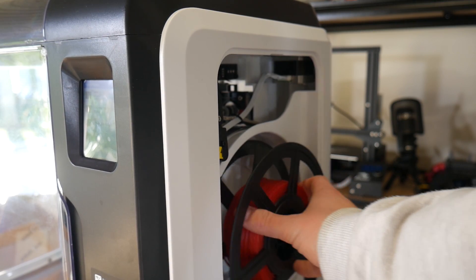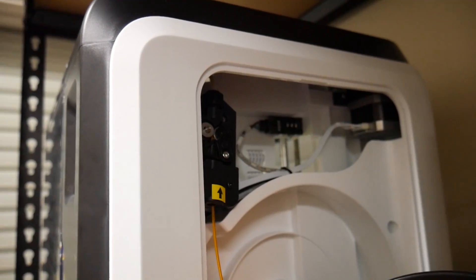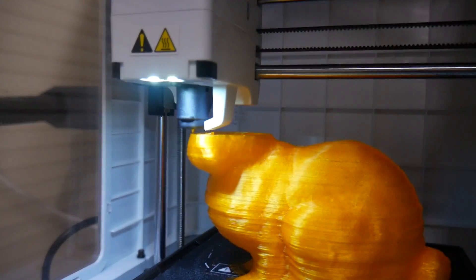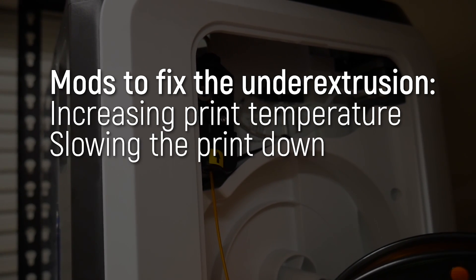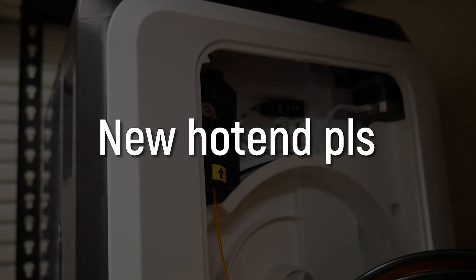At this stage, swapping between the sample roll and a few other filaments, I noticed the extruder start to click. The print quality got worse and then went insane — I have no idea what happened to this rabbit printed in ABS; it's just an absolute disaster. What caused this is unknown to me. It might have been a time thing or caused by one of the filaments I was testing. But researching the Adventurer 3, I found the clicking extruder is a well-known issue. Some people have found success increasing the printing temperature, slowing print speed down, adding an oiler, or modifying the bowden extruder. I just told Flashforge to send me a new hotend.